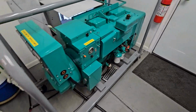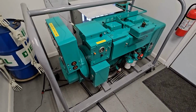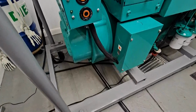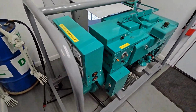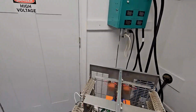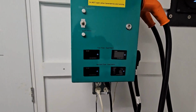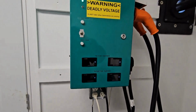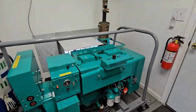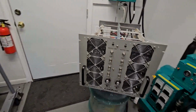What are we going to use? We're going to be using this DJC. This DJC right here, out of the factory, was 12 kilowatts, but we modified it for 15. We put a 15 kilowatt head on it. We're going to play with various loads, using the meter panel right here, the top level of meters, which is this guy and this guy right there. 10 kilowatts will not bring this down to its knees, but we'll listen and see how this guy behaves as we apply different loads.